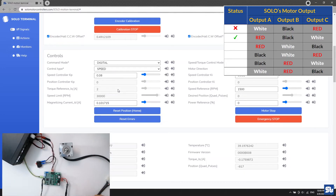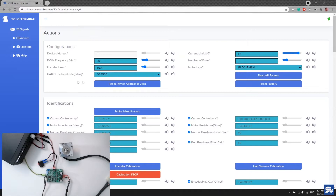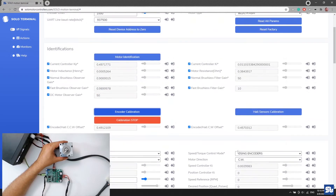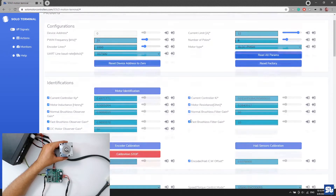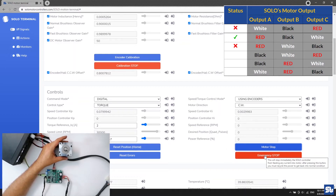Out of curiosity I test the remaining four combinations. I turn off SOLO, change the wiring combination including the center connection, turn on SOLO, connect in Motion Terminal, and run encoder calibration again. The motor rotates counterclockwise, finds the index pulse, and comes back. The encoder offsets are totally different. In torque mode the motor shaft is blocked — changing direction makes no difference. This combination is not correct.